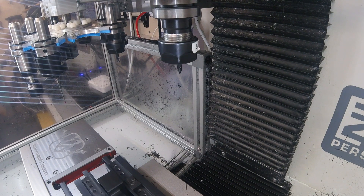What we're doing is part of the manufacture of the housings that mount on the side of the probe to convert them to wireless. The main bodies are machined already, and what I have to do here is put a little opening for a micro USB connector on each side. They're small enough to put two of them in a 4-inch jaw simultaneously, so what I'm going to do is run them as two separate work offsets, and we'll get the probe to do the probing automatically.